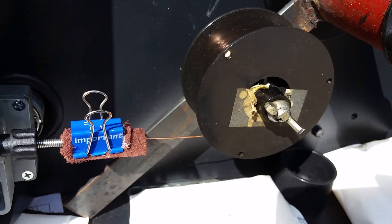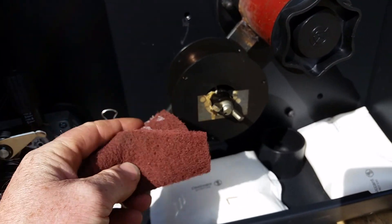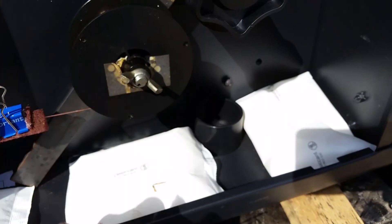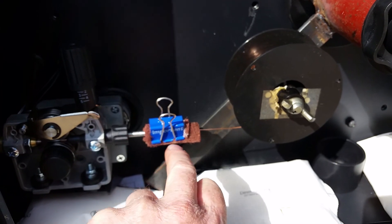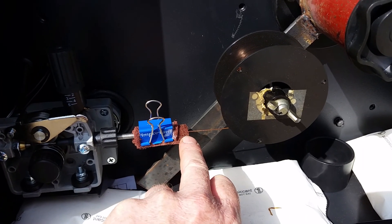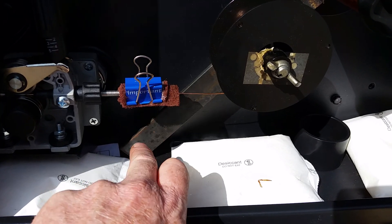Just while we're in here — a paper clip and a Scotch-Brite cloth, wrapped over a few times, with the MIG wire running through the middle. As the MIG wire runs through the middle of this, it will catch dirt, debris — whatever. Every little helps to keep your MIG wire clean.